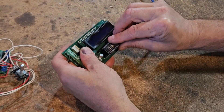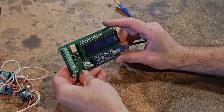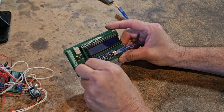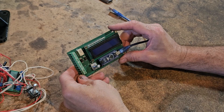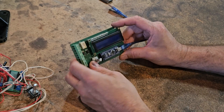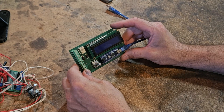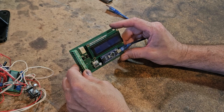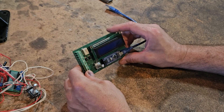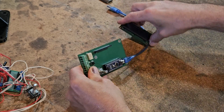The Arduino pops in and then the THC is ready to function. To use the THC you scroll through the menus and when you want to select a menu item you just push it — scroll through the menu, push it — that's how you enter all the inputs. One of the problems we had is when we added the opto isolators as surface mounts, we forgot to add a couple resistors, so the opto isolators didn't work. That was a design fault on ours.